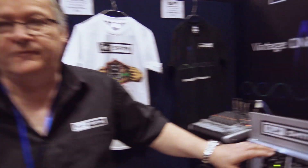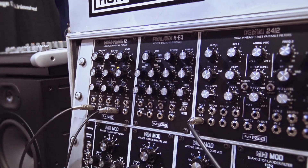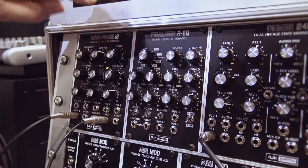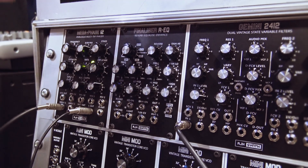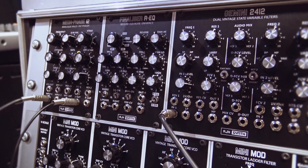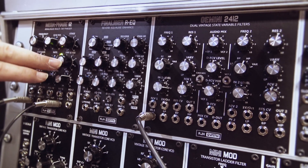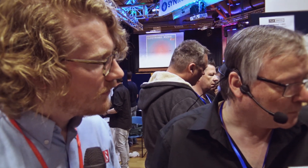And obviously with Tony's blessing, I've just sort of picked that up again now to put it all together into this. So instead of it being 4-stage, we've actually taken it up to 12-stage. We have an 8-way rotary switch to select the phase stage used for output. But what's rather unique is that the emphasis — the feedback or resonance loop — we can select separately. So we can, for example, take the output from stage 4 or take the resonance from stage 12.